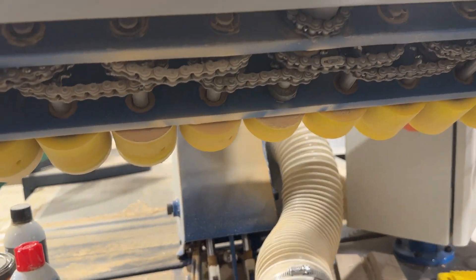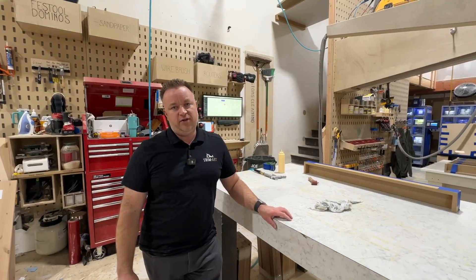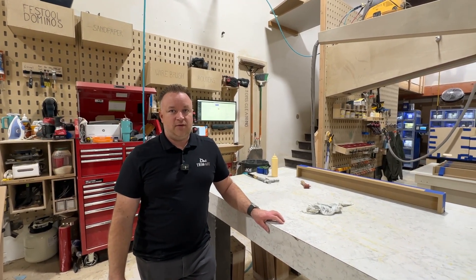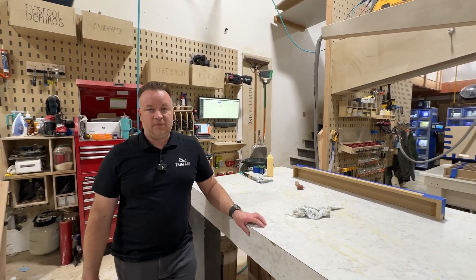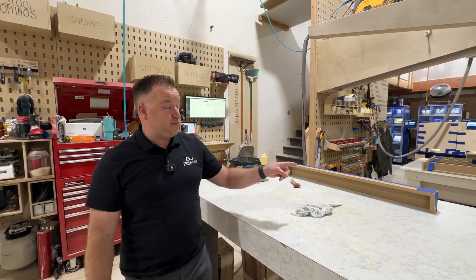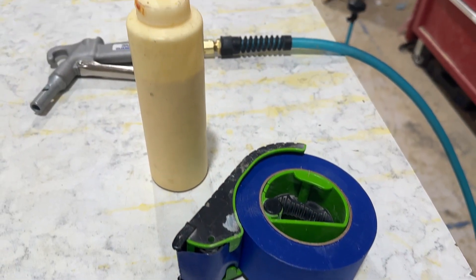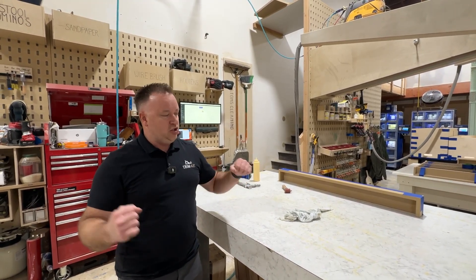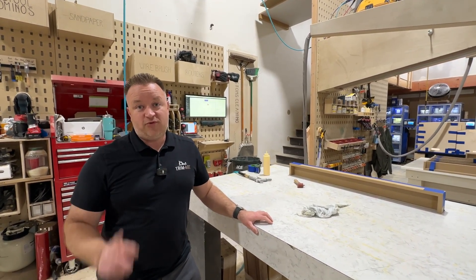The lock miter machine is in the low to mid 20s — that's where they're at, though we bought ours a few years ago. As for tips and tricks, tape is a clamp — that's probably the biggest thing. Blue tape is great because it doesn't peel veneers and doesn't leave a residue. Use tape for clamps instead of trying to hassle with bar clamps and squeeze clamps. Just use tape, fold them up, and it makes it easy. Thanks for watching — we'll see you in the next video.